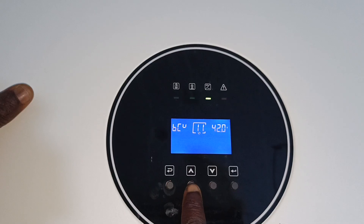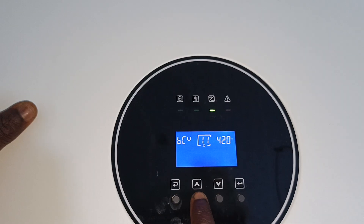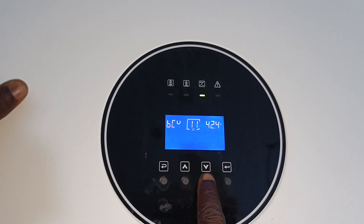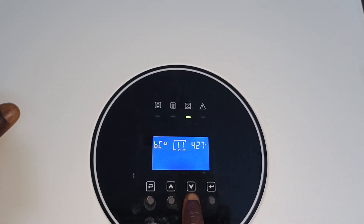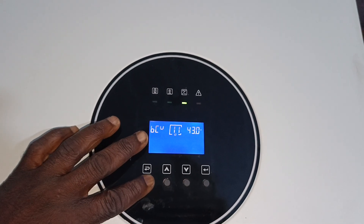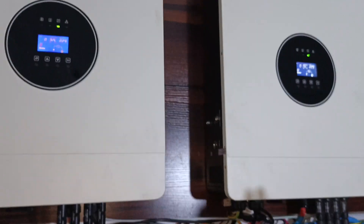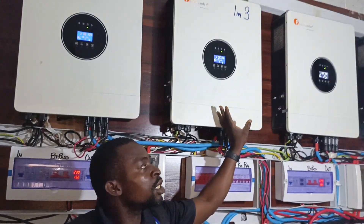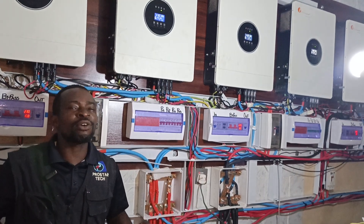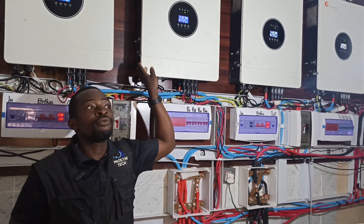So you select, then I'm going to increase it to 44. Now, 54 is the highest, as I'm telling you. So we are going to take it — okay, I'm taking it to 43. I've set it to 43. It's going to apply to all these inverters, not only this one. So immediately it gets to 43, it shuts off, instead of getting to 42, because from the factory setting it comes in at 42.